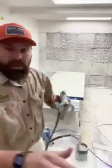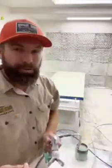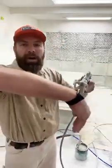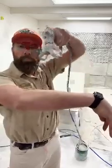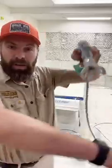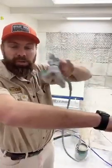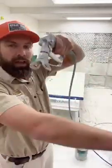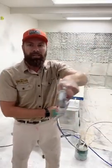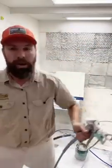So typically, how we teach our people is think about those videos of the auto manufacturers, how they have those robot arms and they spray. They basically follow, if you have a curved contour like this, that robot follows the contour exactly, always keeping the gun parallel to it. It never goes like this, it's never swishing and washing and things like that. So it basically just nice follow things. So if you can see the hands like this moving across like this, think of yourself as a robot.